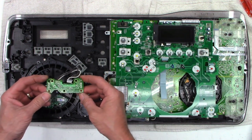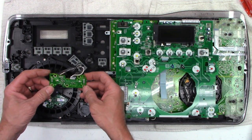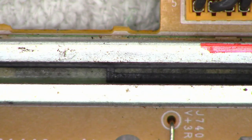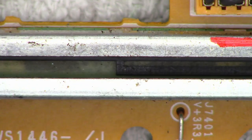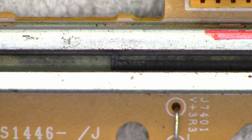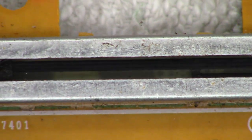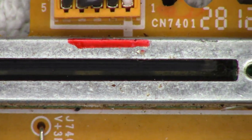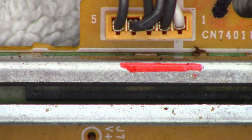I'm going to have to make some resistance measurements on the pads and find out which ones are actually used and which ones are not. There doesn't seem to be any key or anything on this pot. Looking down in the middle right here, I see there's a single carbon path that leads from the right side and joins the center slider right in the middle, going over to the left here and over to the right on this side.